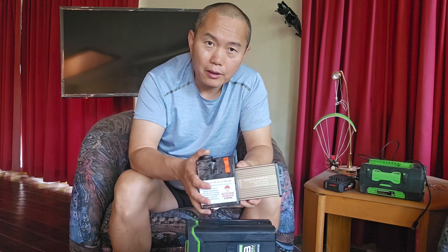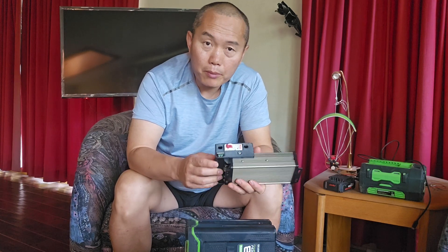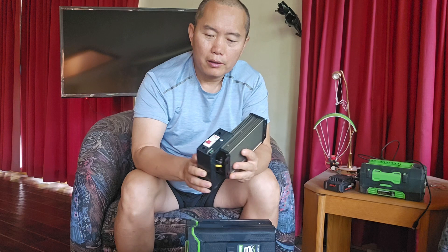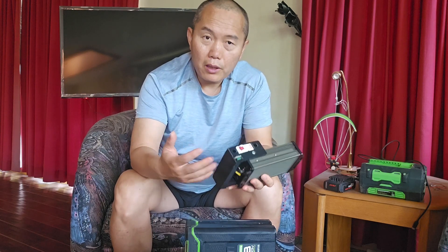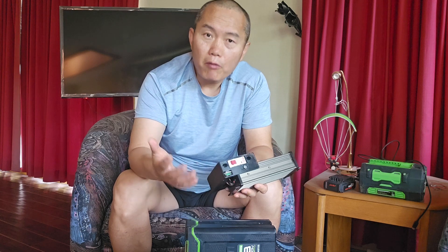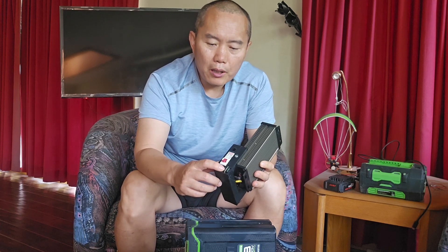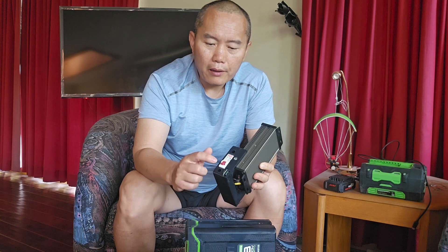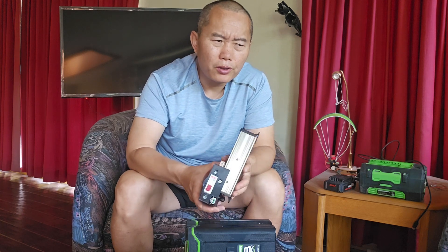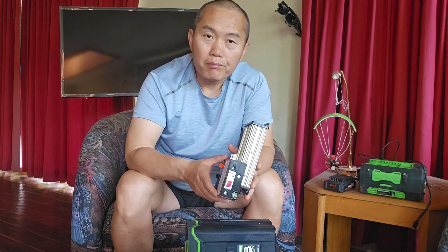Other applications like a case player or stroller will definitely work too. My upgrade here is changing the regular USB port to a USB-C port. The regular USB output is only 5 volts at 3 amps, which is only about 15 watts — enough for a slow phone charge. The USB-C outputs 12 volts at 3 amps, which means 36 watts.